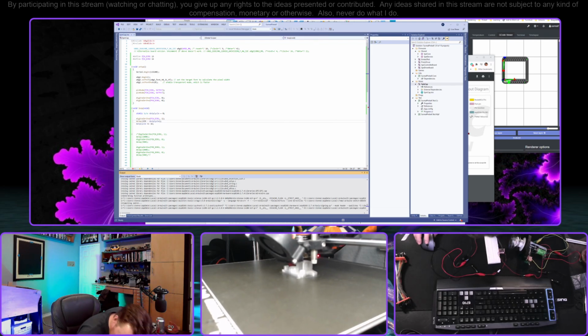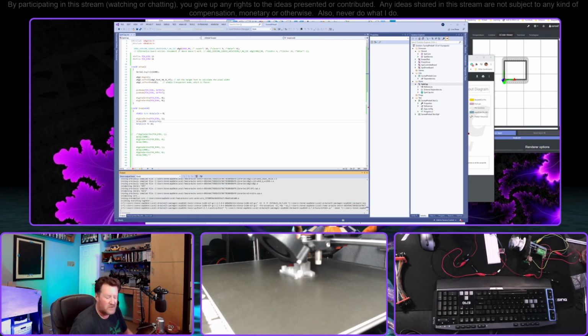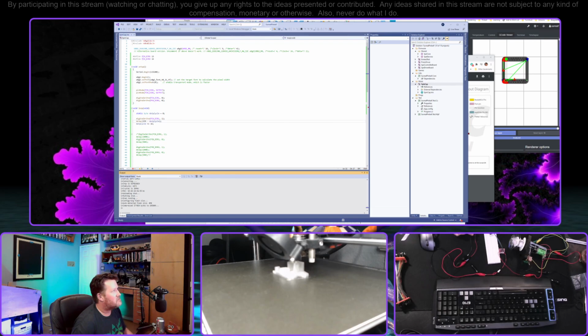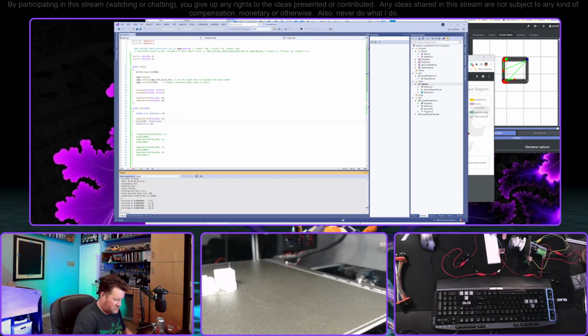Oh, that's funny. Okay, so this whole time, I don't know if you guys can hear this on stream, but I've been hearing this kind of whining sound that's sweeping up, and I assumed that it was the music that I had in the background. It's not. I can hear the H-bridge turning on and off at high frequency. So basically, I think that we're just switching it too quickly. Or if this is getting hot. Nope, we're good.